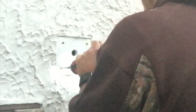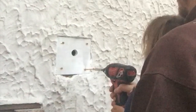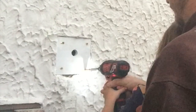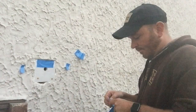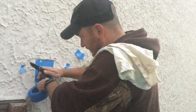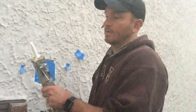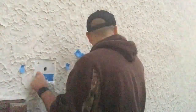After that, I went ahead and put some screws in through the pilot holes I already drilled. Those pilot holes are important because you don't want to go through all this work and then have the wood crack. My daughter came in and helped me put one of the screws in, and as you can see, she does a pretty great job. Then, because I hate caulking so much, I put some painter's tape along the edge about an eighth of an inch out, so when I went to caulk it would look as smooth as possible and be easier to paint later.